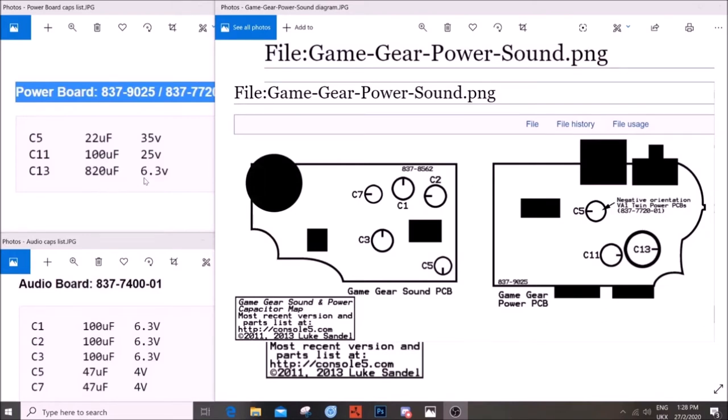So I was unable to find the 6.3 volts, and unfortunately had to go with a 16 volt, so an 820 uF 16 volt capacitor, as shown earlier in the video, where you see the very large tall blue capacitor in comparison to the shorter Game Gear black capacitor. That's why I'm trying to check mine, because I have so many of them, and luckily I found two or three which are okay, but I will still endeavor to find the originals of all capacitors and replace them at a later date. But they will work fine probably for the next 20 years,